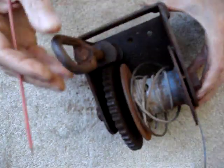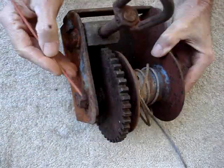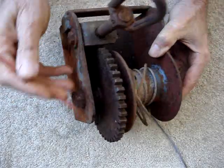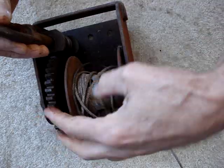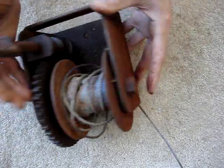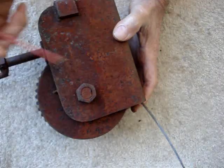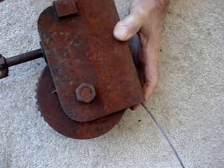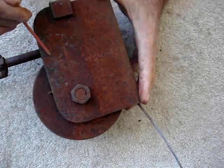To make it a unitary spool I'd have to remove one side of the frame. The bull gear, spool, and shaft all in one piece would use what I call top-hat bearings — flanged bronze bearings — one on each side with the flange on the interior. But you can't get the unit back into the frame with a unitary shaft sticking out. So that side has to be removable.